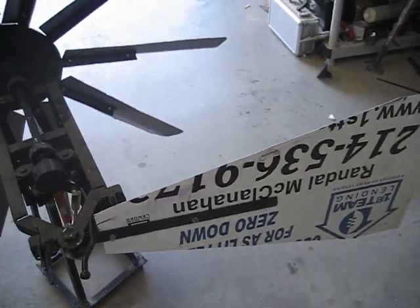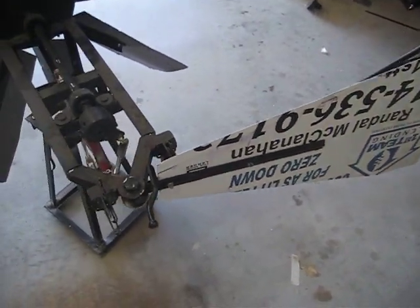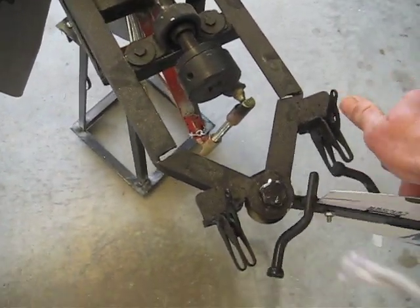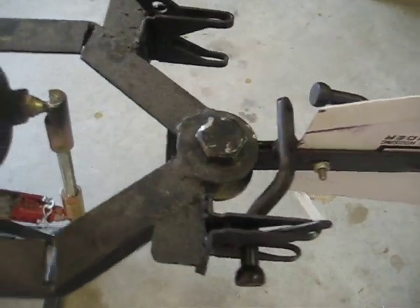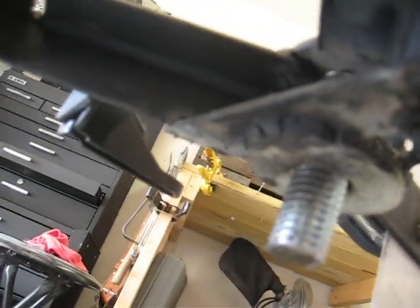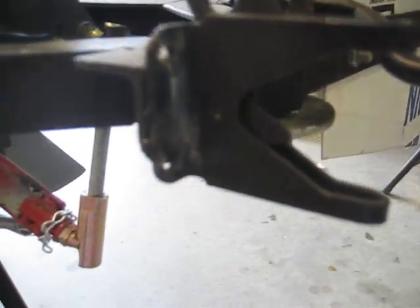I've cut it a little — it may not be large enough. I won't really know until I get the whole assembly up on the tower to see it blowing in the wind. The pivot is made up of two large washers welded onto the angle on the top, and then on the bottom I welded another with a small piece of steel to bridge that gap. I also made a couple of small brackets out of angle iron to attach the gate latches.